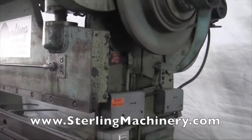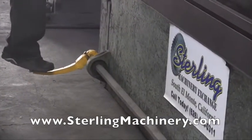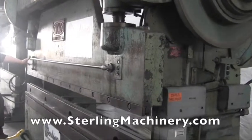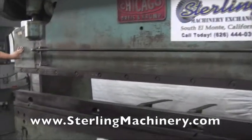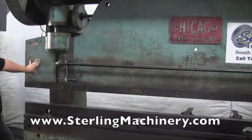If you notice my foot over here, you'll see how I could feather it down nice and easy. You'll see the ram coming down very slowly. So if you have a job that you got to feather into or move around a little bit, you can go ahead and do that and stop it at any point. But with a mechanical, you are always going to have to complete the entire rotation. We'll show you that again. We can go ahead and slow down, start and stop at any point.